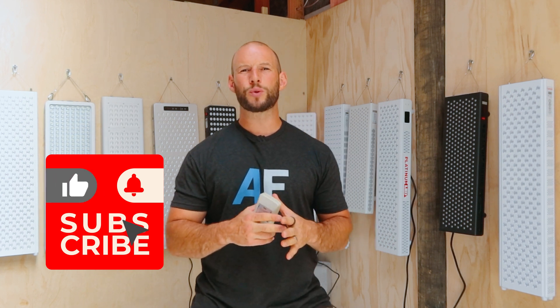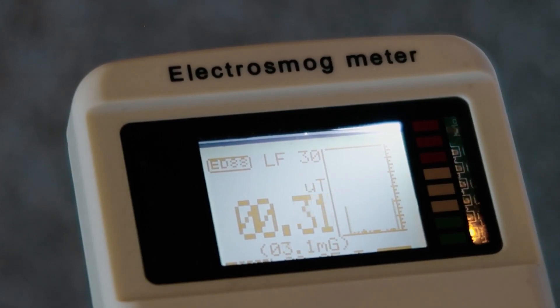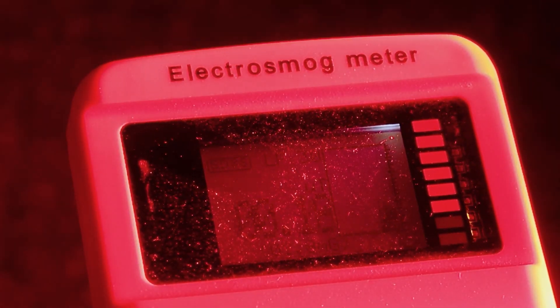If you watched my 2019 body panel comparison, I only did my testing at six inches. I was going to do that again today, but what I found after doing a lot of testing and reviewing of these panels is the panels are so much better now from an EMF point of view. Back in 2019, we were getting some pretty high EMF readings, so there's no need to go to six inches because obviously they're only going to get worse the closer you are to the panel. But now with these new generation panels, a lot of the readings at six inches are pretty much rock bottom, which makes it hard to compare and hard to decide which ones are the best.